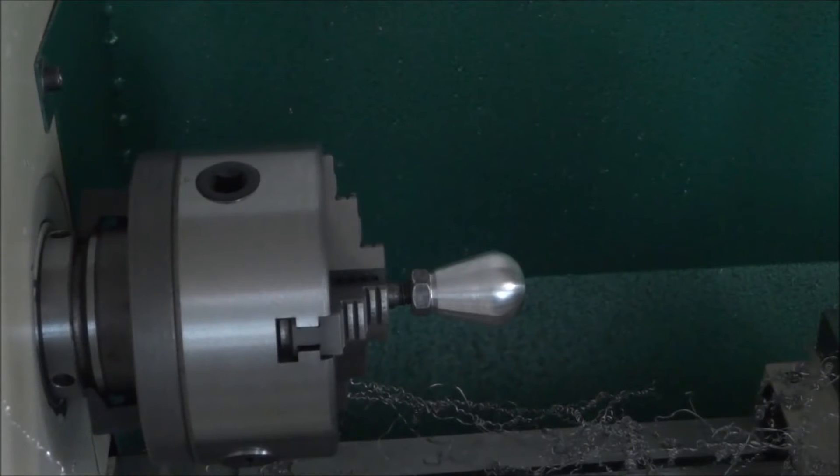I don't know if you can see this - very smooth. So what happened was when I ran it the first time I was doing 15 inches per minute and only about 800 RPMs. This time I went 10 inches per minute at about 1000 RPMs, and you can see - very smooth. That'll polish right up, and considering this is just a very fine tip on the end of this bit, very nice. Very happy with that finish. That's what it was - I just needed to tweak the feed and speed a little bit, and it turned out real nice.